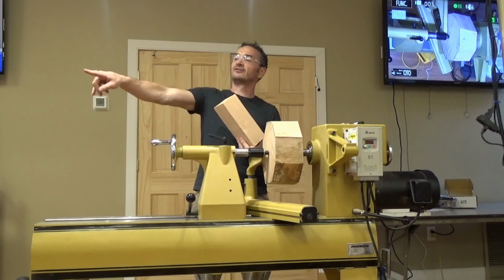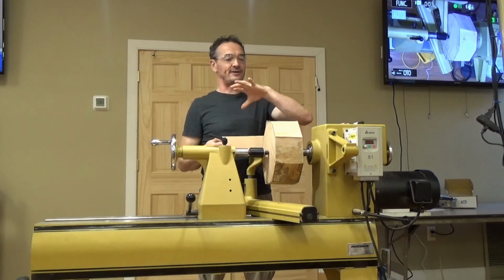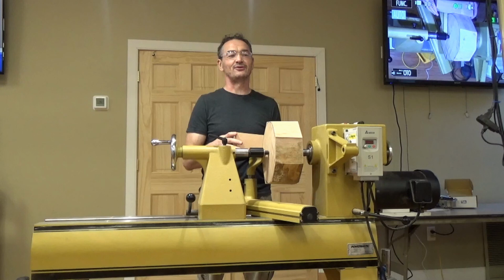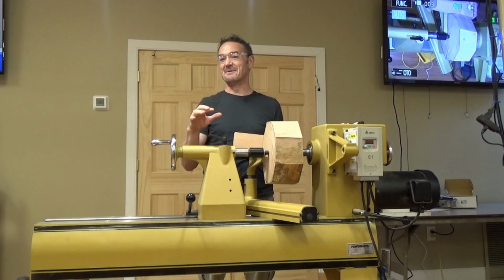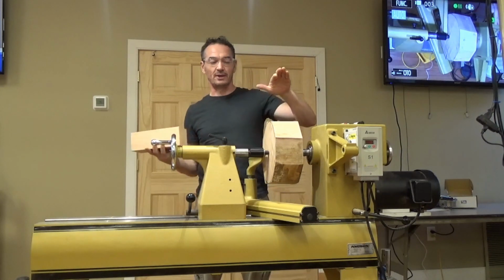The cherry bowl over there is side grain, and the natural edge ones are side grain. End grain bowls are a different dynamic, and I don't normally recommend making them. End grain bowls became quite famous through a few people in Hawaii who started making bowls to sell, but actually didn't know how to turn. So they didn't know you weren't supposed to turn the bowl out of end grain. But side grain bowls are the best way to turn.